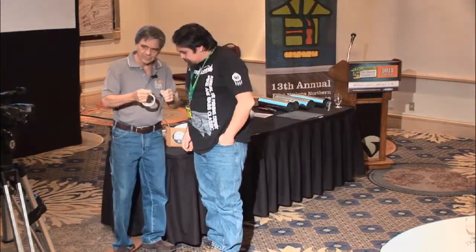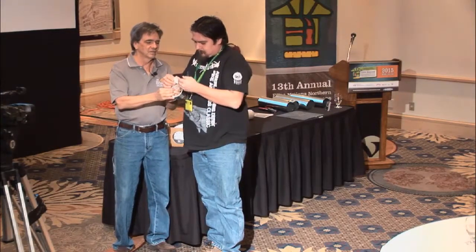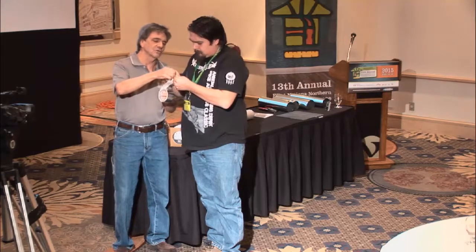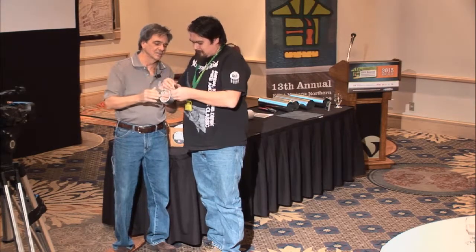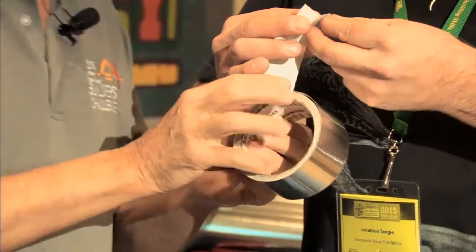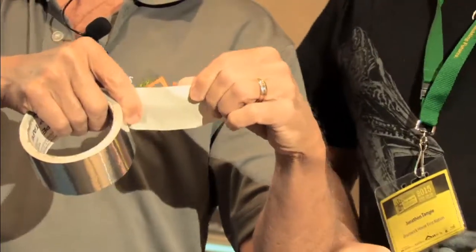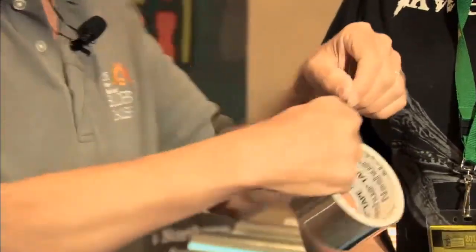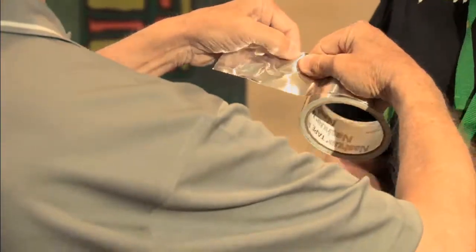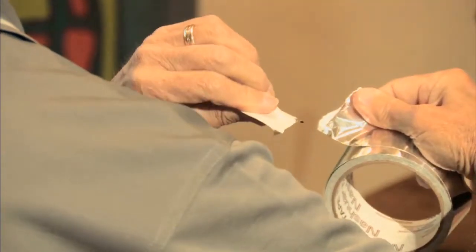Okay? So let's do it one more time here, if we can get this on the camera really right. Get in close. There she is. So we're going to come halfway down like this. We're going to just keep tearing, but I'm going to change sides. And always one edge of that is going to be open. The other will not be. And suddenly it becomes easier to use your aluminum duct tape. So that's one key to using this stuff.